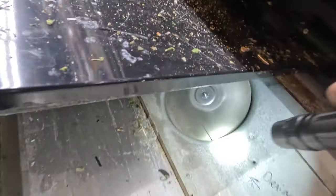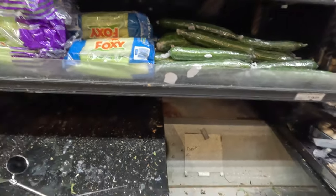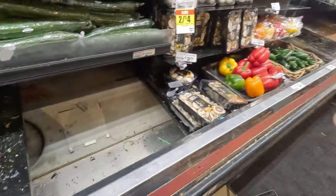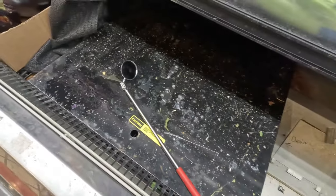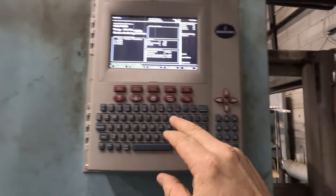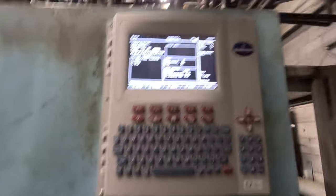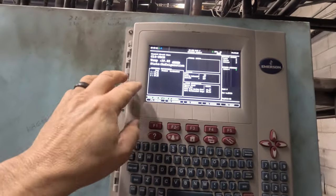I did not see any ice at all. They do have some of the same similar sludge in there. But the thing is, you could spend forever cleaning this place because they don't do maintenance. And so they wait until it gets bad enough that it causes problems, and then they call. So at this point, I'm going to call it a day. I mean, it's not perfect, but it's also 30-some-year-old cases — and you can tell half the fins down there were about rotting off, so probably not transferring to the aluminum, which then gets the air into the air path. We're going to go ahead and put this back to what we originally had, which was 37. All of them are really in the same vicinity — 29, 28, 31.